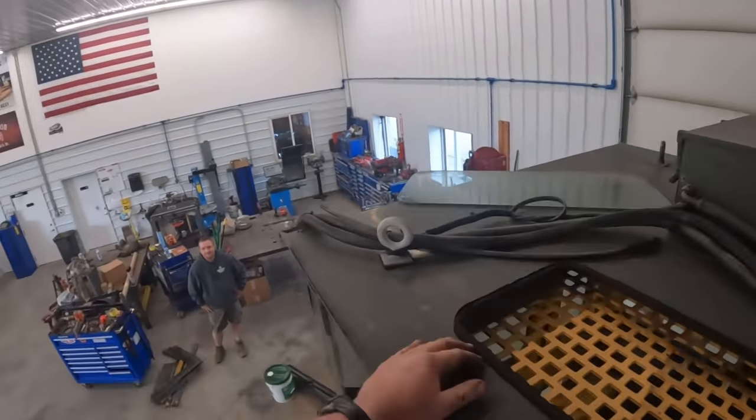Alright, after talking to Kevin, we have a little bit of change of plans. We was going to take the old crane and pick that dude up, but there's no lifting eyes on top. And the way this thing's made, I think we're going to pick it up tandem with two forklifts up under here. The center section, the window, front and rear, is unbolted, so it should stay there in theory. Hopefully it doesn't fall down.